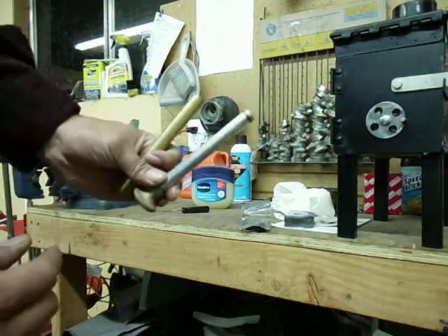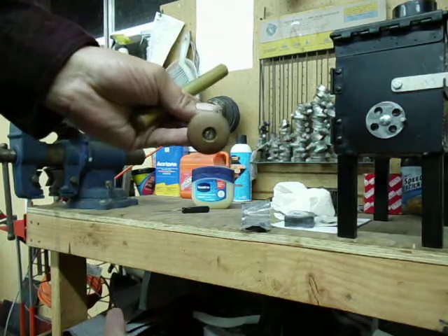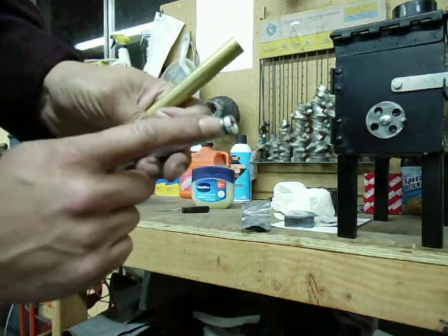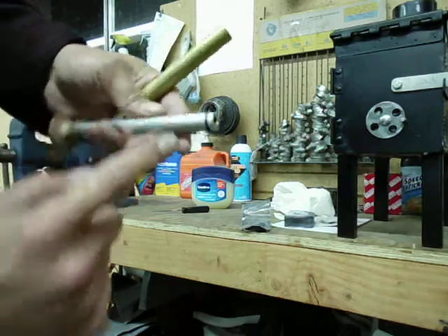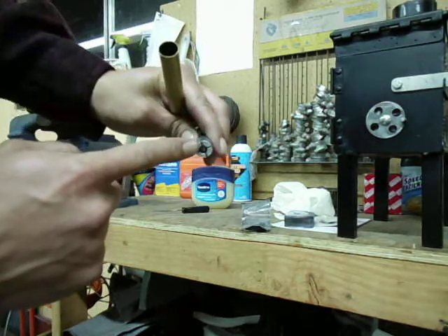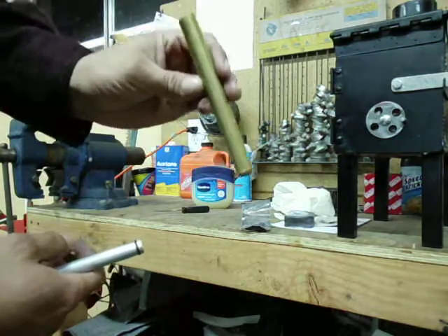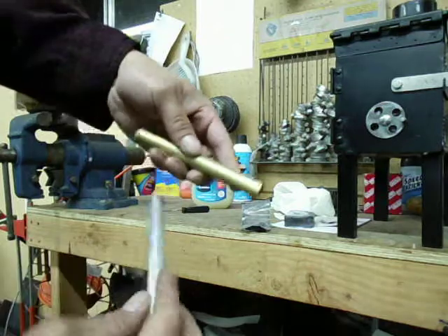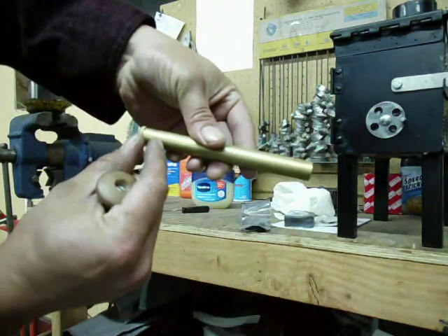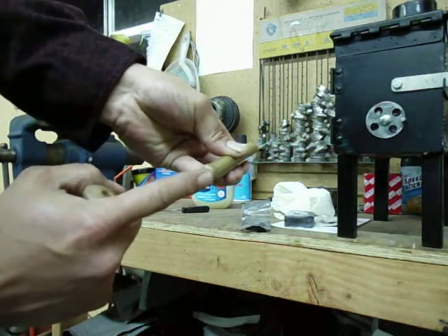And this is what we're looking at here. It's just a half inch diameter aluminum shaft. I drilled and tapped the end and put a screw and a little wood drawer pull on it. It's got an O-ring seal on the end. I just basically cut that slot with a hacksaw and it's got a hole drilled in the end here. The other half of it is just a piece of brass pipe. The idea is you want this to bottom out in here with about a quarter inch gap at the bottom. It's just got a little wooden plug glued in the end here.